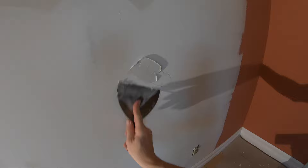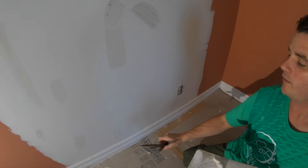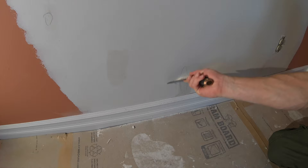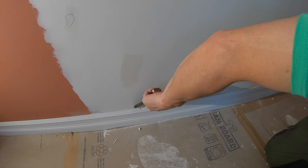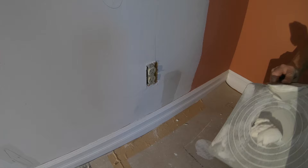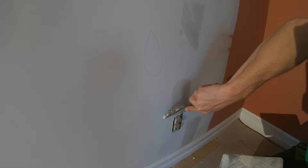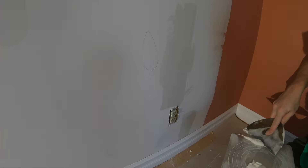This is that spot where I had a slight impression. I'll just put some mud there and wipe it like that — and as you can see that filled it in. That's the line right there we're going to take care of. Down here where there's a chunk in the mud it's going to kind of come up, and that takes care of that. There's a line right here and down here.